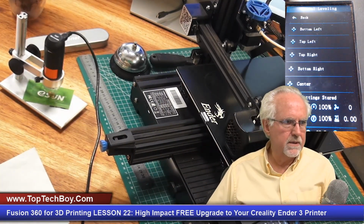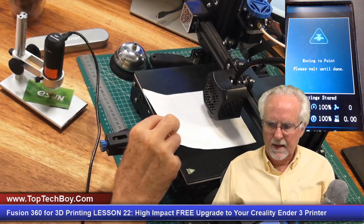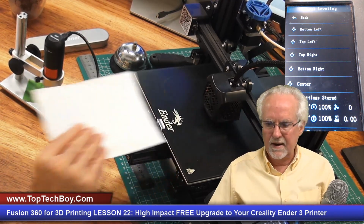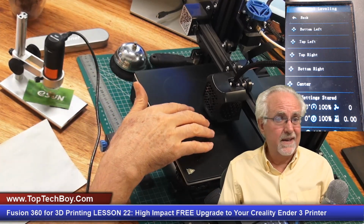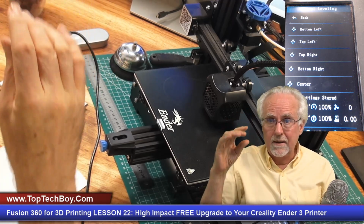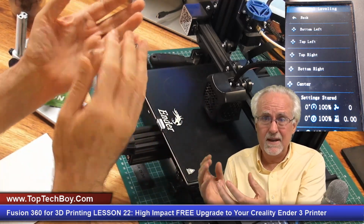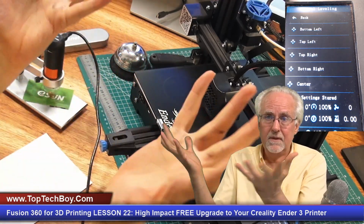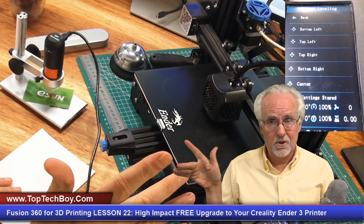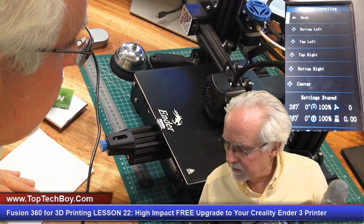Now I'm going to go to center. And now, of course, when I go to center, it is not good because it is low, it's too far away. So what I would normally do is I would come in and tighten the 4 by maybe 1/8 of a turn, and then the center would be right, but then the corners would be wrong. But this is just a manual leveling that you could do if you just wanted a better way to level your print bed. But that is not all we are going to be doing.